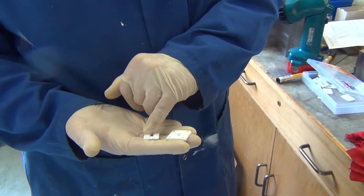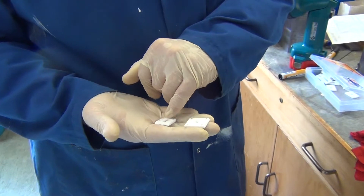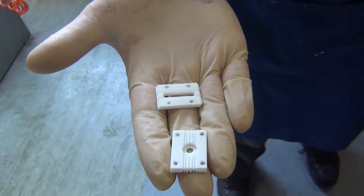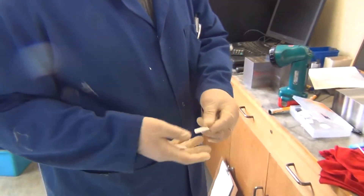So this is a ceramic material, so it's got about a 700 degree rating. Unfortunately, it doesn't machine very well — very brittle — and as you can see there are 0.6mm slots through it. So I've got to run little contacts all the way around it, so a bit of a challenge.